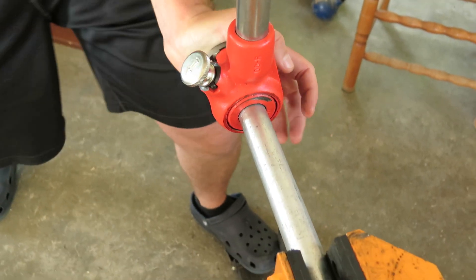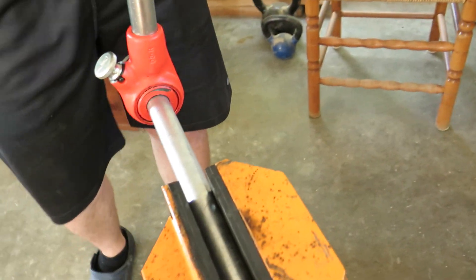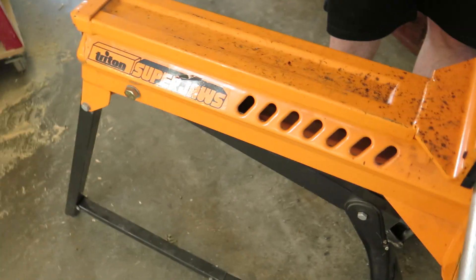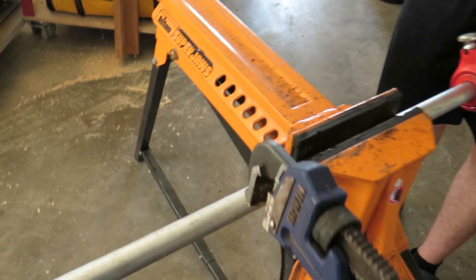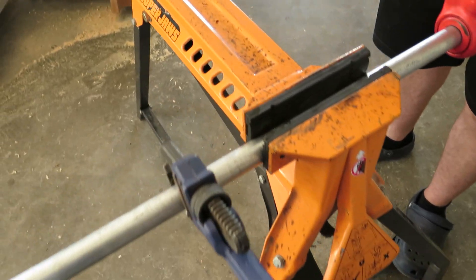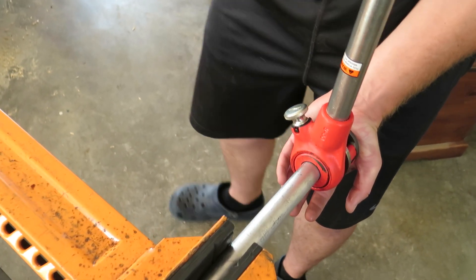The pipe's starting to turn now, so I guess that means it's time for the pipe wrench. Because we don't have an official pipe threading machine or a pipe vise, we just put it in this regular super jaws type thing, then put a pipe wrench on it, and I'm going to be holding onto this pipe wrench resisting the turning force that Robert's putting on.